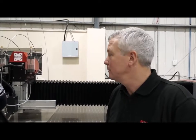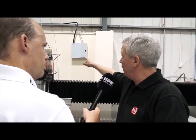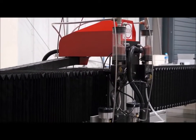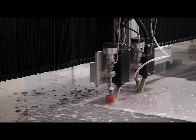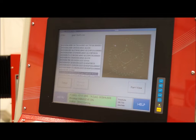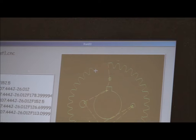With the sand, you've got a bigger drum at the back of the machine where the sand is held and fed to the heads — is that correct? Yes, at the back we have a pressurised system that feeds up through the clear pipes, and we set the amount of garnet that comes down and mixes with the water. Is that set manually or through the control? It's normally done by the CAD-CAM software. If I had a specific material or metal, the software would indicate how much sand I need relative to the water. Basically, I just describe the material and thickness and the software sets everything — the speed, the quality, and the amount of sand needed in the process.